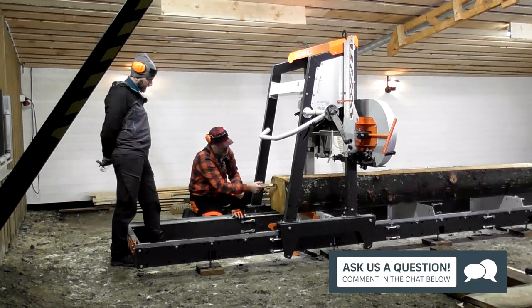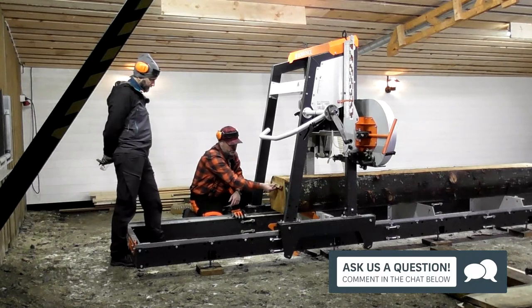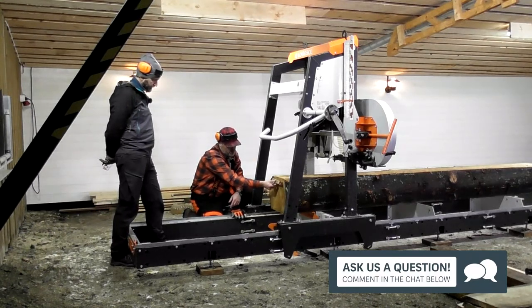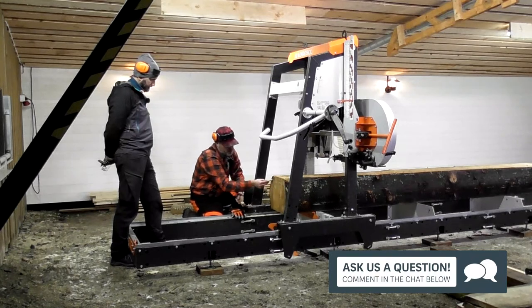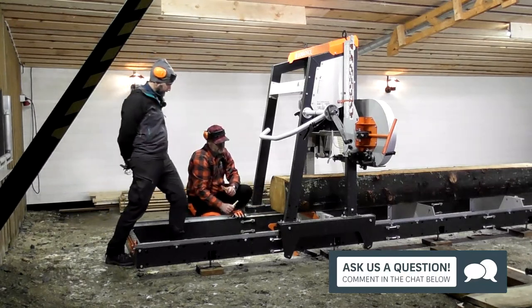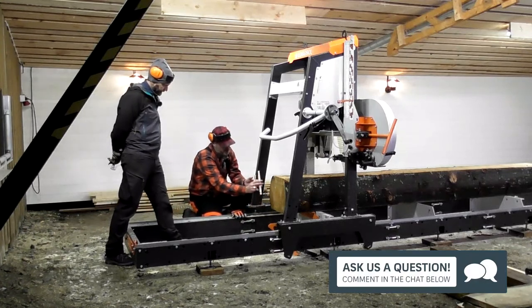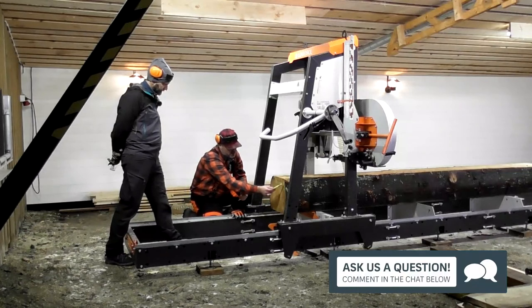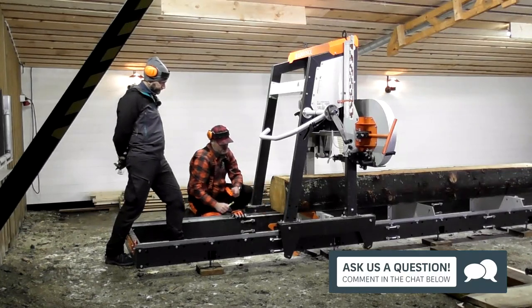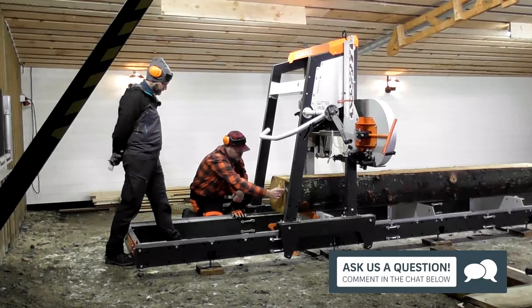So we're going to start at 10 inches. Actually, we can use the saw head to measure 10 inches. Then we will move up 1 inch and make one cut, go down and cut again. Then we'll have our 10-inch cant. That's to get the center in. Exactly, that's why you cut two. If we then turn it up, we can start slicing it into proper boards or planks. We're going to do 2-inch planks in this.